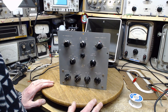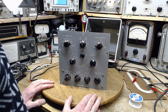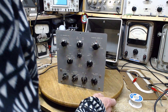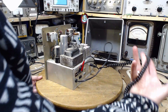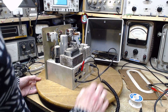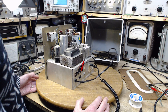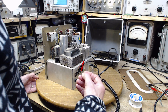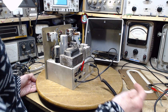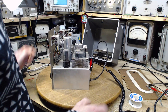This is a very interesting radio. This radio has no front end — it's dependent upon the front end of some other radio, any other radio pretty well. What it does is it has an input on the back that a cord is plugged into. This input would connect to the last IF amplifier in a radio. In some expensive communications receivers there's actually a terminal on the back which has the IF output on it, and that IF output from the first radio is fed into here. From here it continues through this right to the speaker, so this thing requires the front end of another radio.